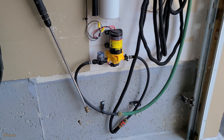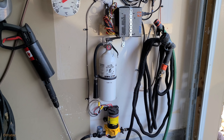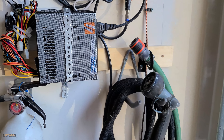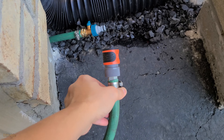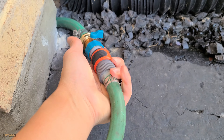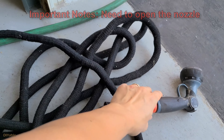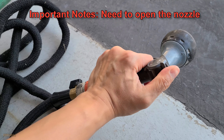The setup is completed — that looks pretty neat. The output of the pump is connected to the flexible garden hose in black. The water intake is connected to the hose in green. Each time I need to water my plants, all I need to do is grab this hose and connect it to this quick connector. This runs along the wall on the side of the garage and connects to the rain barrel, controlled by this valve. There's one thing you need to pay attention to: you have to open your garden hose nozzle, otherwise the pump will not be able to prime because there is air inside.